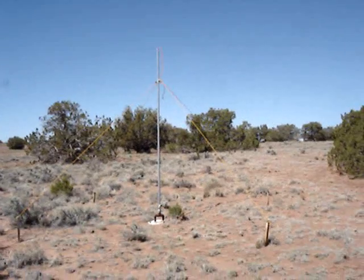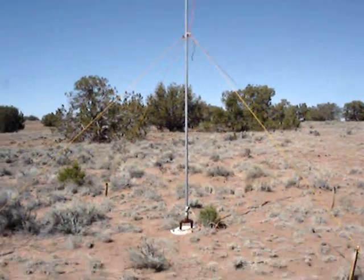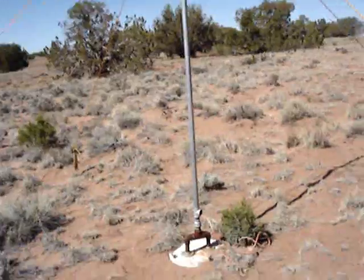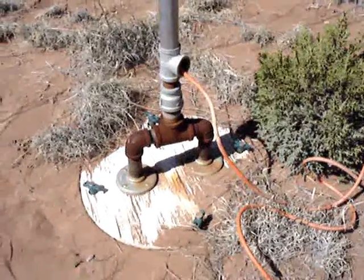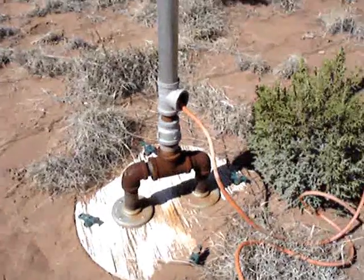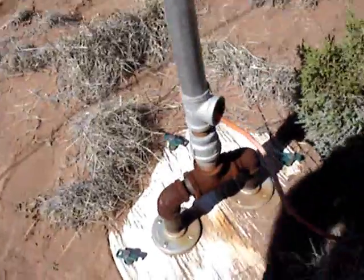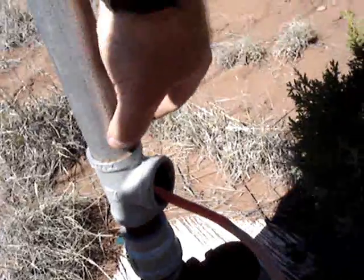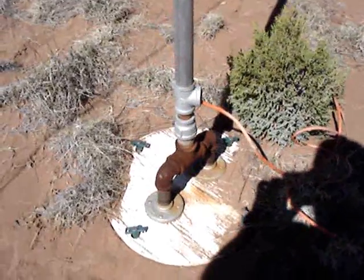There's the tower up with its new ropes. I use a torpedo level to make sure it's plumb and adjust the tension in the guy lines to get it as plumb as I can — probably not perfect using only a torpedo level, but it's good enough. Down here is another view of how the base of the tower works, and you can see the wire coming out through the opening in the T. A lot of people don't quite understand how I've got this set up. Basically, this is plumbing fixtures here and this up here is electrical conduit. The electrical conduit is just a slip fit over a pipe going up through it. I've got the hinge built down here and it's sitting on a base of plywood — I think from the pictures it would be easy enough to understand, but hopefully the video will help too.